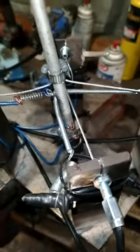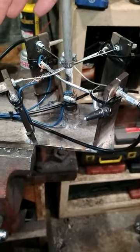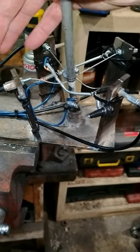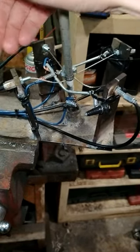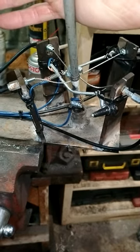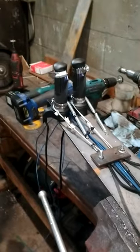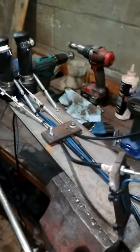When you go in reverse it touches both springs — I checked it with a multimeter and it does work. That will reverse both motors at full speed. When you go right, it gives the left motor full speed forward but the right motor full speed reverse. Time will tell if that works well, but we couldn't find a joystick so that was the best alternative.